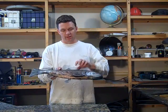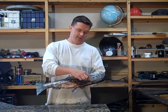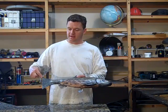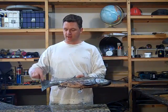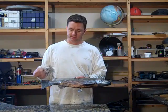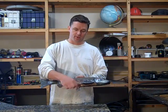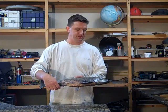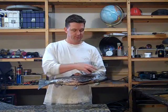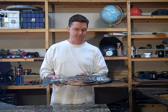Then I overlay stainless steel on top, copper on the bottom, inlay copper here. I fabricate the top fins out of mild steel and this fin here out of mild steel. Then I braze on the lower fins out of copper after they've been hammered out of sheet copper. Then I use the MIG welder to give it its texture and then sand and grind it down.